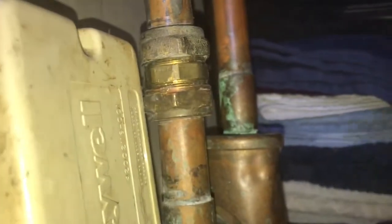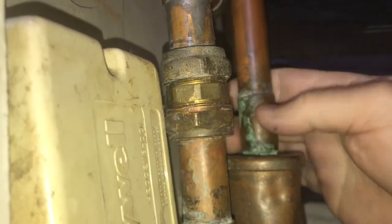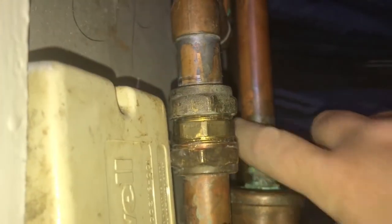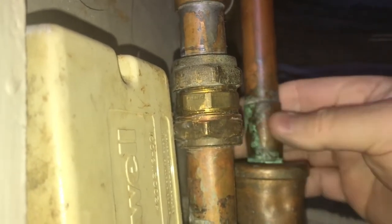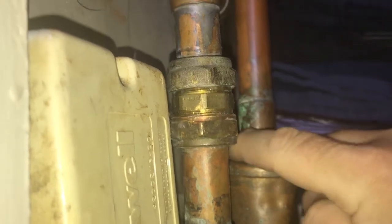I've got my airing cupboard and I'll just talk you through it a little bit. This is my airing cupboard upstairs — I made this door myself many many years ago. If you look down here, you can see what I'm talking about: this green patina on the copper pipes, this is called Verdigris. In this situation it's flat and smooth — this is just where the plumber has literally not wiped the flux off.